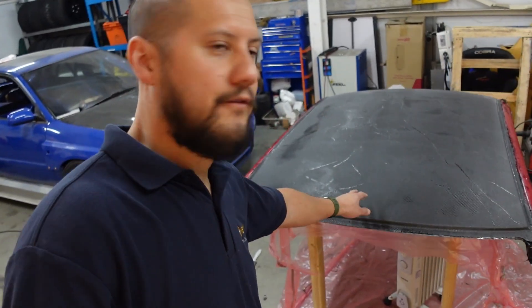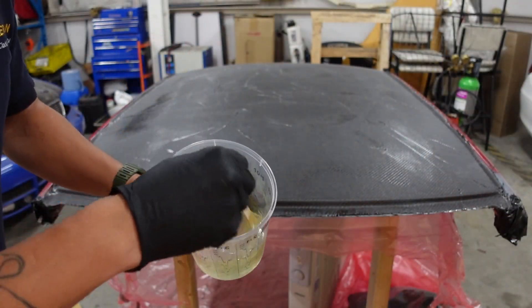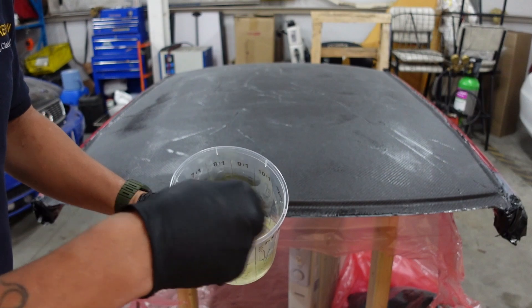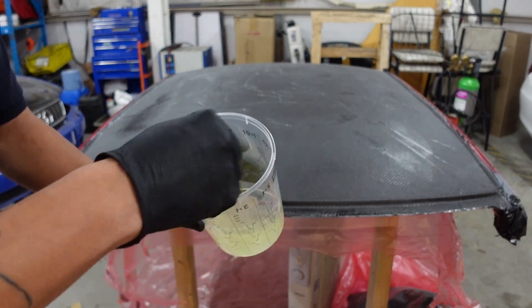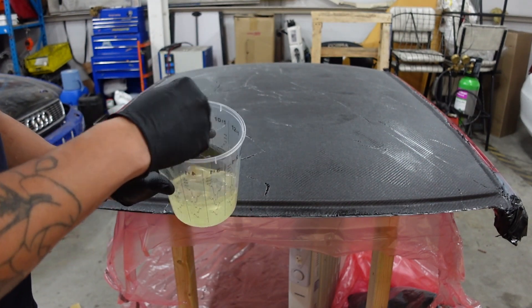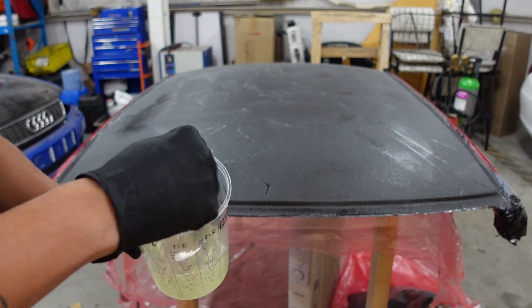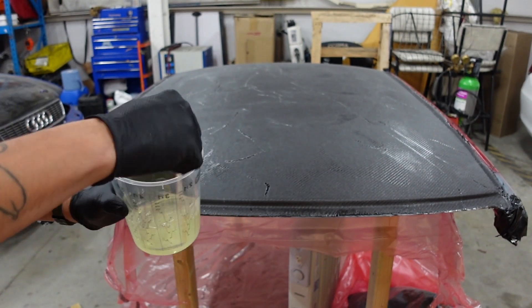It's very matted at the moment because of the peel ply and there are some wet bits and some dry bits. This is all going to get sanded down and then finished. Where the areas are dry, I am doing another coat of resin over the top - just going to slap it on there and leave it to go off. That will enable me to sand these areas without damaging the drier spots. All mixed up and ready to go.